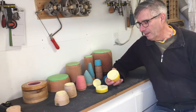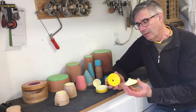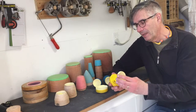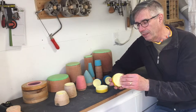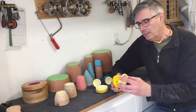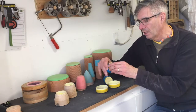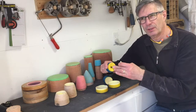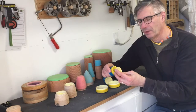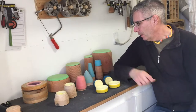So this video is about making inserts for the Carter Products ball jam system. I figured out how to make some rubber, which you'll see later on, and made these nifty inserts, nice and soft, so they shouldn't scratch the balls when they're sanded. The originals are a little firm, and I found that they mark the balls when I'm sanding them.